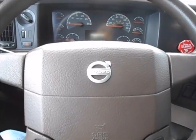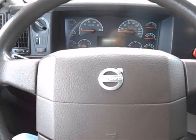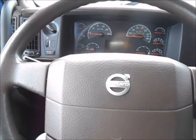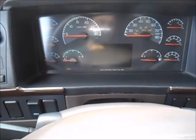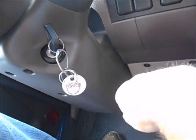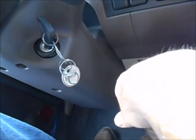You're a little familiar with how these gauges work and you're not being surprised by anything. The interior of your truck might look a little different than mine depending if you have the raised roof or the mid roof with the fairing. This is the raised roof version. There's your key switch. Turn it back for the auxiliary power, turn it forward once to engage the computers and motor to get it ready to prime, and then turn it forward to start the engine.